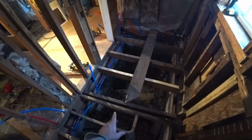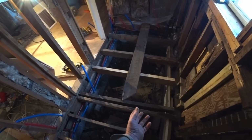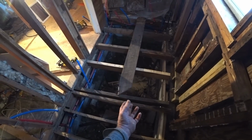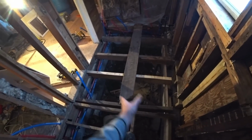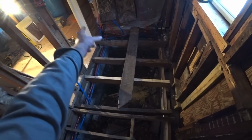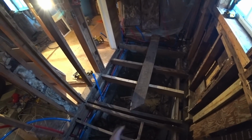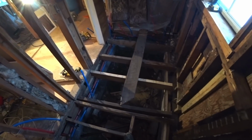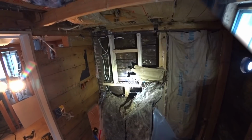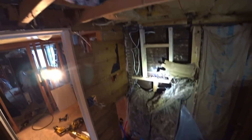But so we got that set up, and with doing that, now I can get a PVC 45 little joiner thing that's a lot better than a clamp, like a saddle mount, that I can actually tap in the other lines and run them up for the bathroom sink. It'll all be the right piping and all glued together and never come apart as in this irrigation hose. So just doing it right, you know what I mean? But I think I got it pretty set up now.